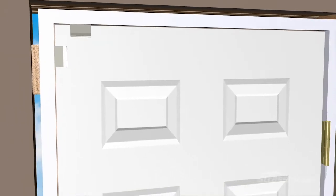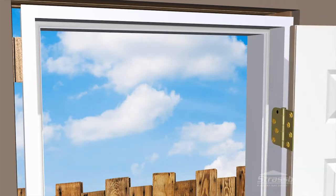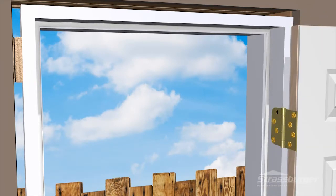At this time, check the top corner of the lock side. You will notice two shipping spacers, one at the top and one on the side of the top corner. All spacers should not be removed until the door is correctly installed and operational, as these spacers act as a gauge to maintain the 1/8 to 3/16 inch even space that is required.